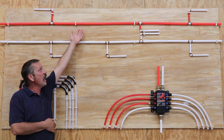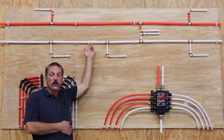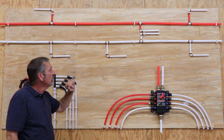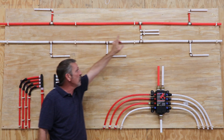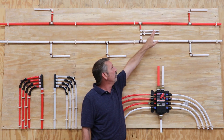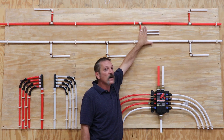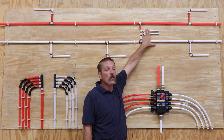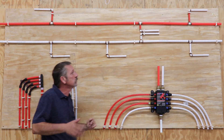In this simulation, I have red for hot and white pipe for cold. In PEX you can also get blue, but we did away with the blue because it's just one more color. If you notice on my hot lines, the last little stub-out part is white. We do that because we don't want to see red and blue pipes poking out of the wall — our stub-outs we want to be white. It looks cleaner and much better.